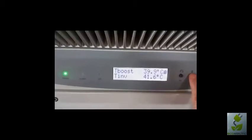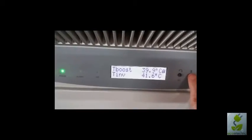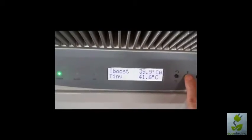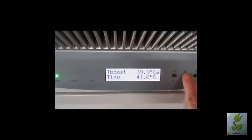Some temperature readings. The unit's actually running quite comfortably there at the moment. It will derate or start to derate at around about 50 degrees and it will operate quite happily up to around about 65 degrees internal temperature.